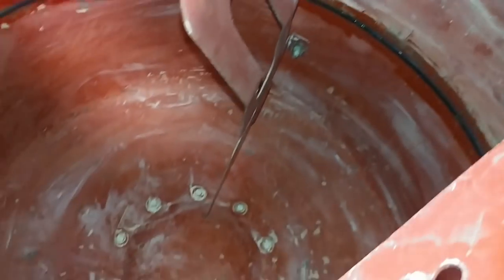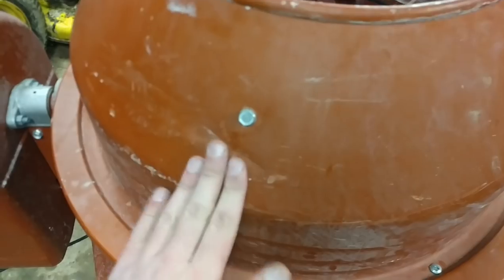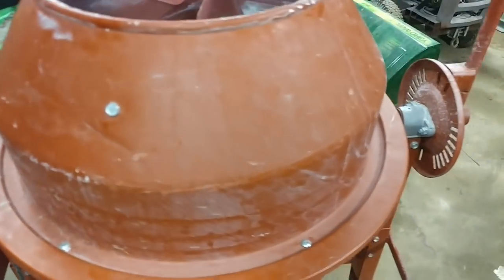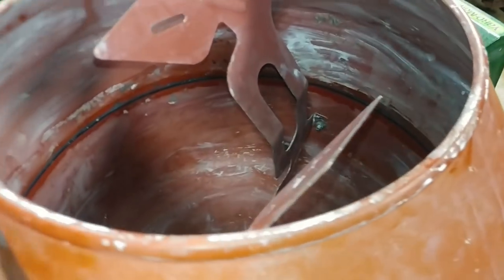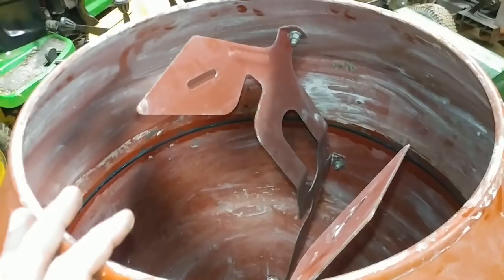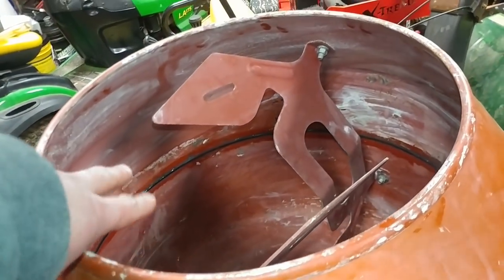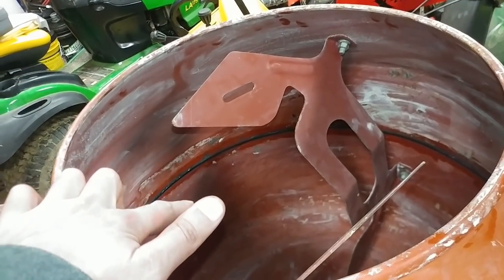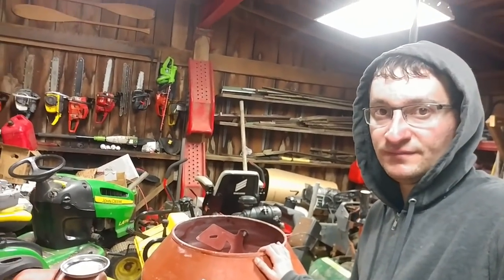These paddles are definitely back in the same places - there's a little wear mark right there and it looks pretty good. It's definitely a lot cleaner and I was able to get that dent out on the side. There you go - that is how you take dried-out cement and concrete out of a mixer. I did put silicone all the way around on both edges of the gasket - top and bottom. It'll probably get worn away eventually but we'll see. Hope everyone enjoyed this video - don't forget to like, comment, and subscribe for more. Thanks for watching.